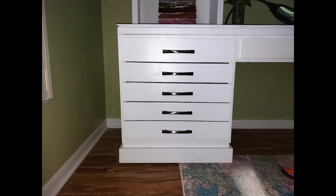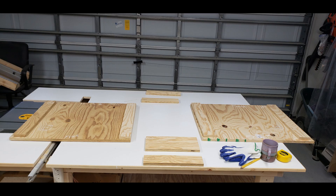The two outside cabinet walls will have raw edges facing the front which will be covered with finished facing. The measurements of the sides will be floor to countertop and front to back. Subtracting three quarter inches for the countertop, the sides will be cut 29 and a quarter inch high and 24 inches deep. It isn't necessary to have a solid back. To measure the front bottom: three and a half inches for the skirt, one inch for the space, and one and a half inches for facing equals six inches high. The width is 24 inches minus one and a half inches equals 22 and a half.